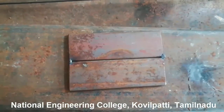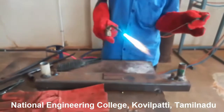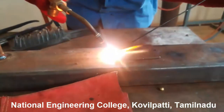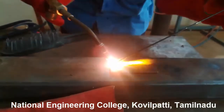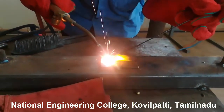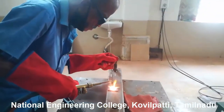Now we have made two dots. The torch should not touch the workpiece as it will create backfire — maintain a gap of 3 mm between the plate and the inner core of the flame. The torch is maintained at 50 degrees and the filler rod at 40 degrees. We heat the filler rod to melt it and the melted metal is placed over the gap. Give adequate time for melting — too much time causes accumulation, and too little time results in an improper weld. Move the torch and filler rod gently towards the area being welded.